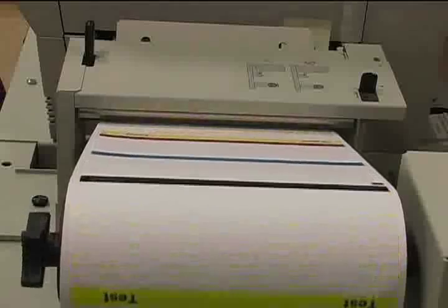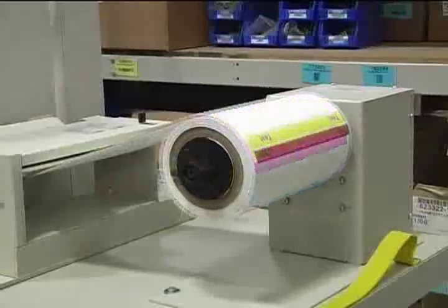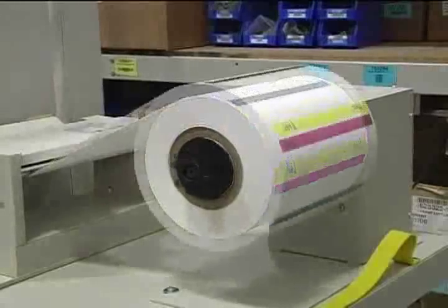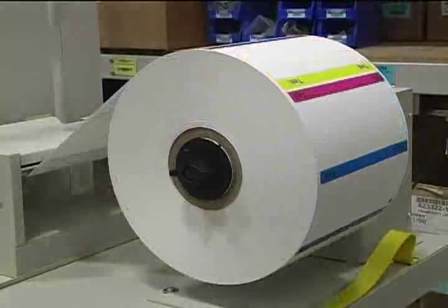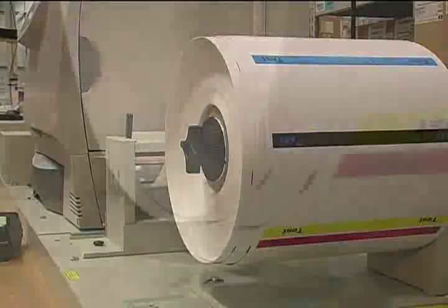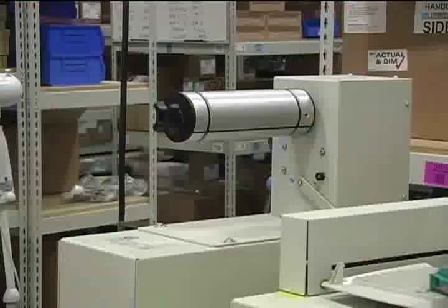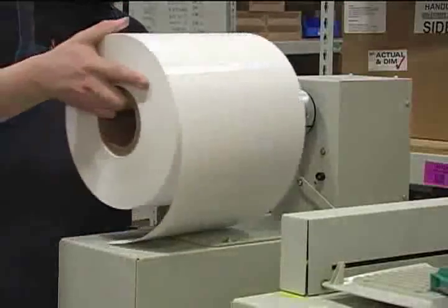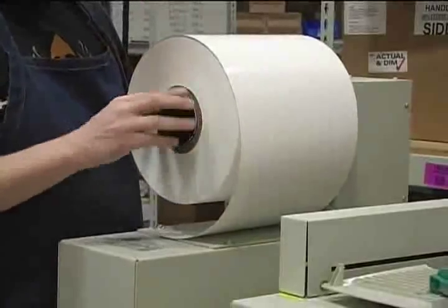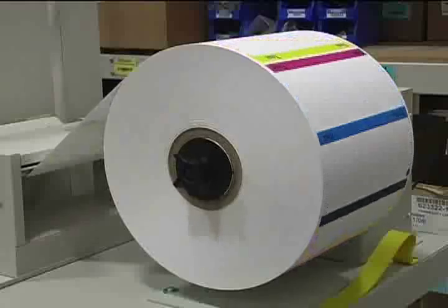If at this point there are still issues which are unable to be resolved, it is possible that the calibration of the printer may need to be re-examined. When the unit is properly calibrated, it is a good idea to test a large job using an entire full roll, as well as running jobs using other types of label stock. Occasionally, some calibrated units can see a deterioration in the quality of the wrap towards the end of a large job — this can be corrected with some fine-tune adjustments. If the wrap suddenly begins to drift before the completion of a 1,200-page job, increase the tension control setting. If the unit is perfectly calibrated for one type of label stock but doesn't wrap as well for another, try making slight adjustments to the rewinder to calibrate it to the new stock, then go back to the original stock and see if it still works with that material as well. This concludes our tutorial on the calibration of the CX-1200.